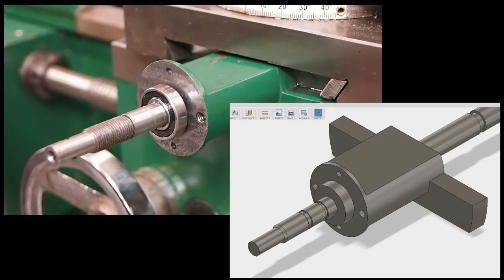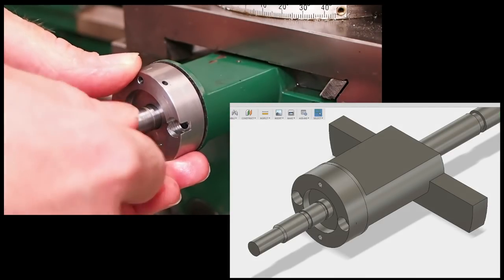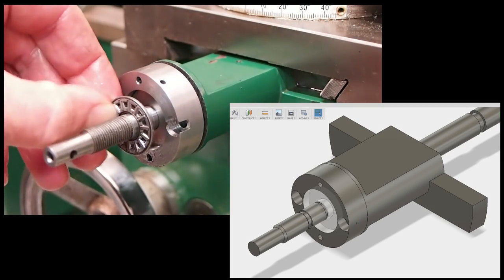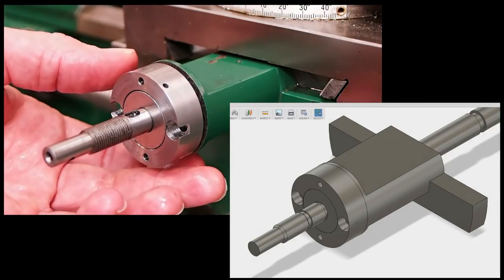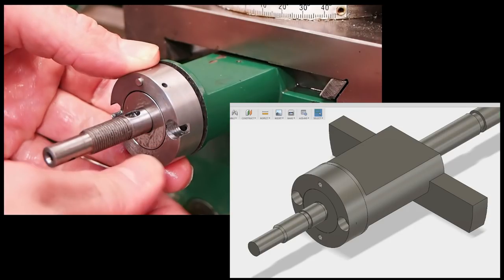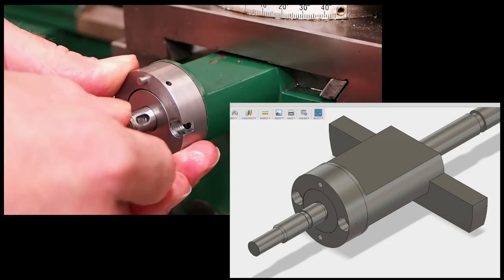A standard 6900 2RS ball bearing was the start of this modification. The lead screw needed a small section turned down to 10 millimeters for this. After cutting down the existing plain bearing support, a new housing was machined to hold the ball bearing on the backside and a 10 millimeter thrust bearing on the front side. The housing was doweled to the existing bearing support to ensure proper location. There is enough room to use proper hardened washers with the thrust bearing.